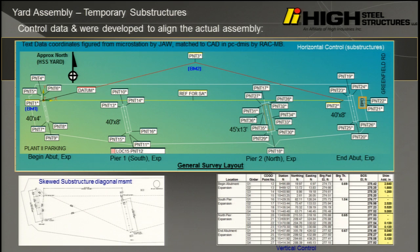I'm basically telling the guy on a walkie-talkie, walk 10 feet forward, slow down, 3 more inches, stop, and we planted the horizontal control points, which were basically at each end of every foundation, every substructure, 2 piers, 2 abutments. And then I just used a level to shoot the bearing points in those 2 lines, like you see building guys do all the time. And then, there it was. I had my horizontal control for an entire bridge.